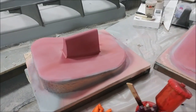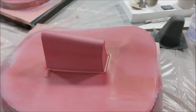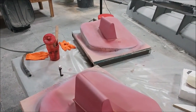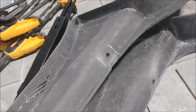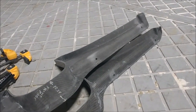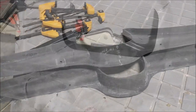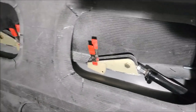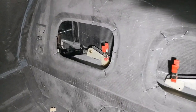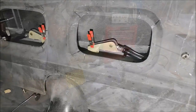Zach's been working on the molds — actually plugs — for the brackets that hold the side sticks. These will be direct-to-mold, so we'll just drape material over them to create the parts. I drilled the holes in the seat mounts to bolt the seat rails, and tomorrow I'll be bolting those rails in and sitting the brackets into the fuselage. Jeff is also adding a small extension to the mounting bracket that holds the end of the gas strut, which pushes the gear down and locks it in place.